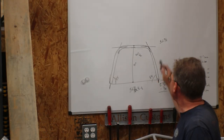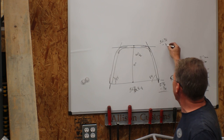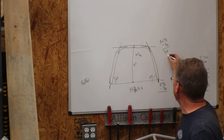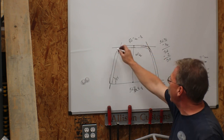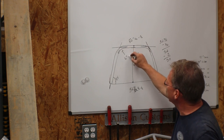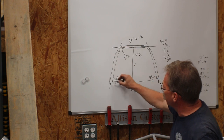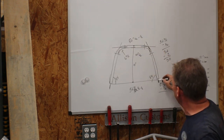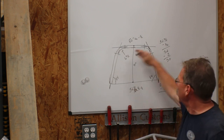At the top, the maximum width allowable is 52 and three-quarters. Subtracting the same three-quarters we subtracted at the bottom gets us to 52, and then center-line to center-line - two-inch tubing means the center line is one inch in on each side, so minus two - gives us a 50-inch center-line-to-center-line measurement at the top. The middle will just work off that angle because we're not putting any bends in it. Our dies are a six-inch radius, so we're going to bend on a six-inch radius, and we need to know where to start and end each bend.